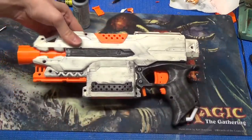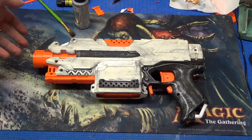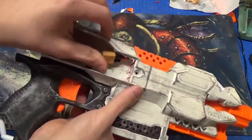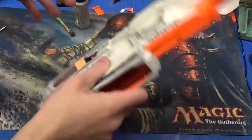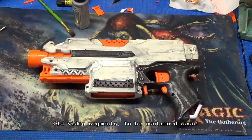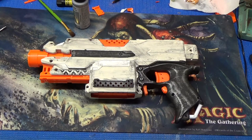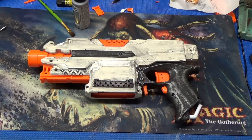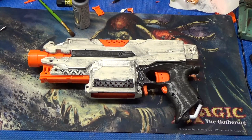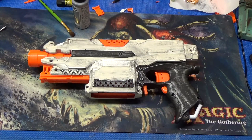I'm pretty much done with the amount of work that needed to be done over Thanksgiving break to keep this project on track. There are a few 3D printed parts that need to go on the outside, so when I go back to school tomorrow I'll start getting that done. For now, the blaster is 100% functional — completely wired with 16 gauge silicone wire, going to an XT60 connector which will sit in the 3D printed battery tray with the 2S LiPo. So without further ado, let's hop back and get printing with some parts.